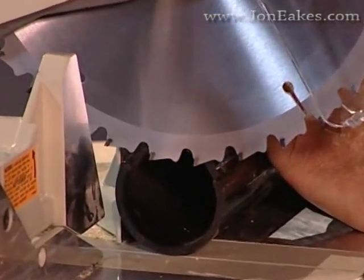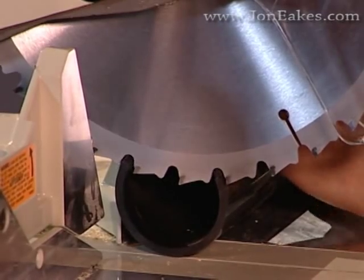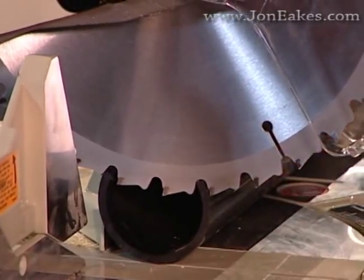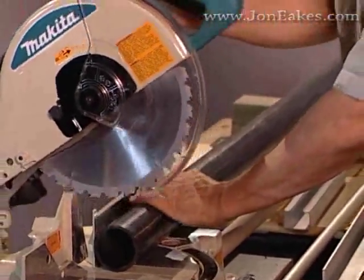As you're cutting down — I've cut away a little bit here, let me show you — as we're getting down about this far, all of a sudden if this pipe rotates, you see how it's going to go right up into the space between those two teeth. And suddenly, if it catches that much plastic, the whole thing's just going to blow apart and jump in your face.